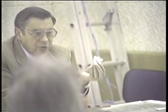When you're in the forward direction, the slip clutch does not slip. There are special little U-shaped dogs, as they call them, that come up and fit into two slots at the bottom of the reel table and lock the upper part. It locks these two parts together so it behaves just like one solid piece. But when you go backwards, the dogs are released, and that allows the clutch to slip a particular amount. There is where you're going to have some tension problems in time. And there is no adjustment for that. That built-in coefficient of friction is there, and if that changes, there's only one answer: replace this whole reel mechanism.